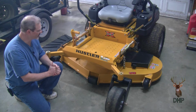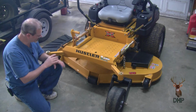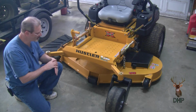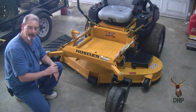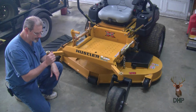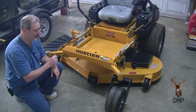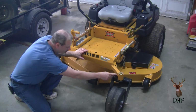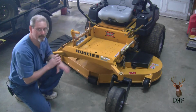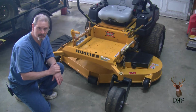Keep it simple, stupid. I want as few bolts as I possibly can, because bolts vibrate loose, nuts, bolts, or worse, they get stuck and you can't get them off. And I like a solid welded construction. Now, if you look at Bobcat and Skag and some of the others, Grasshopper has on the 2600, or I believe the series is, they actually have a bolt-on wheel where the forks, the entire assembly here and spindle can be replaced, and that may be a feature that you like.